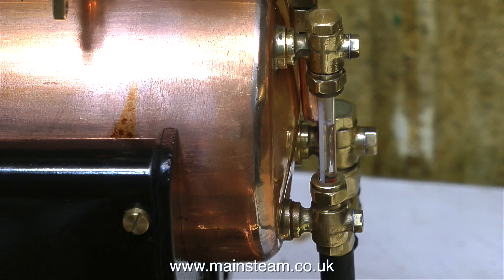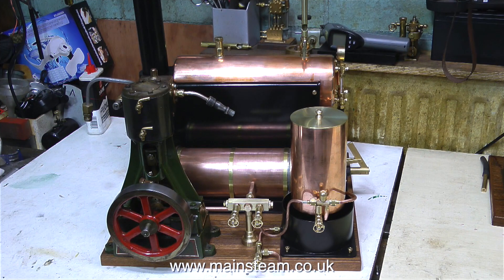I didn't initially plan it this way - I've just realised what's going to happen. If I'm using the boiler hand pump to pump water into the boiler, it's going to pick up warm water from the tank, push it through the feed water heater, so by the time it reaches the boiler it's going to be almost hot, which means the steam pressure shouldn't drop too much when pumping water in. Before dismantling the plant to finish the baseboard and fit the engine, I'll be giving this a steam test - and that will be in the next episode. Thanks for watching and I hope you found it useful.